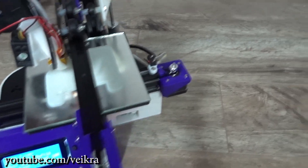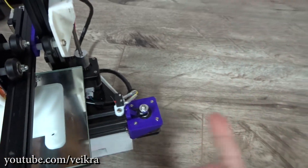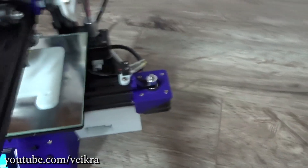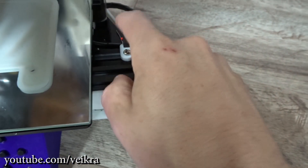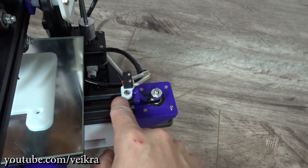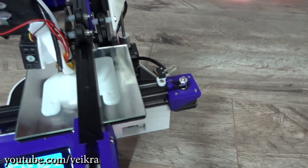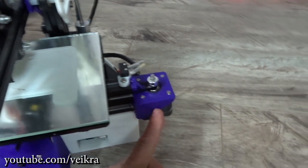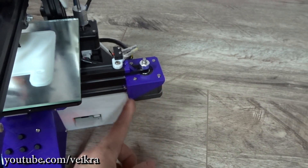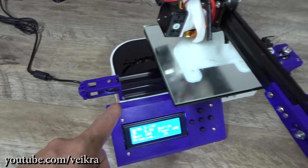It's all one big upgrade. What you need to do is swap over two of the wires inside the stepper, otherwise it's gonna go the wrong way — away from your limit switch when you home it. This little white part here is one that I made; it fits perfectly there. It's similar to the Adverse Effect stepper mount, but I made it stronger because the other one was starting to flex — I think that's because I need to tighten my strap more.